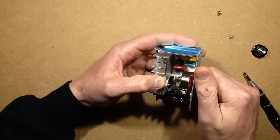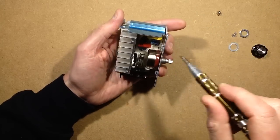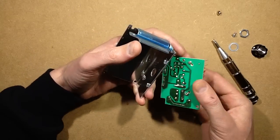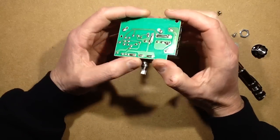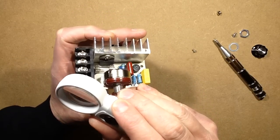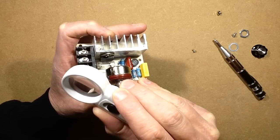The bridge rectifier is kind of throwing me a bit - I'm wondering if it means it's possibly not the usual simple circuit. The circuit board comes out quite clean and uncluttered at the back. That's a triac - I've just seen the ST logo. It says ST BTA41-600B.